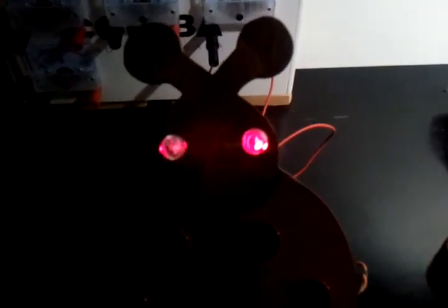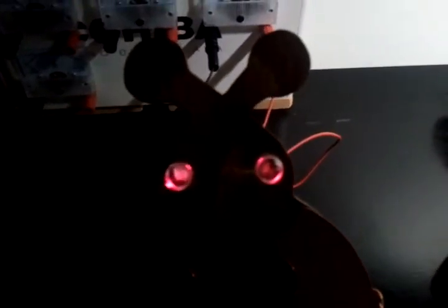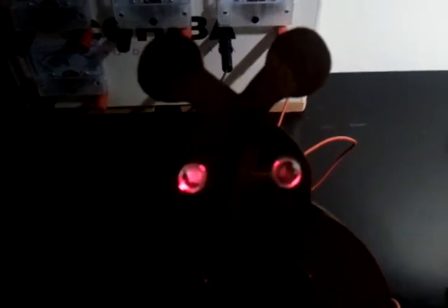This will run for several hours. If I run the fan for about 5 minutes, I can then run another 2 to 3 hours on this blocking oscillator. With the light solid like this, it's going to draw a couple of milliamps. When it gets down to blinking, it's around 40 microamps. That's quite a little cell, and it's been a lot of fun to make. I enjoyed showing it to you and hope you enjoyed watching.